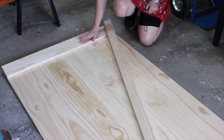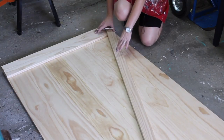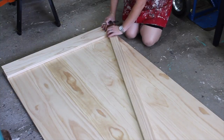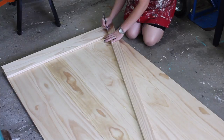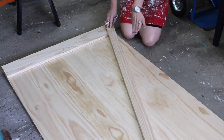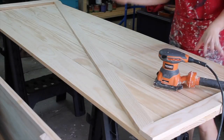Now that these are glued and nailed, they'll act as our clamps to hold everything together — once this is dry it will be nice and solid. The last part of the building is to add the diagonal crossbeam. This is completely up to you in the design you want; I like to just run mine from top to bottom. I line it up, mark my angle, and give it a cut. Just make sure wherever your cross piece goes it won't interfere with the hardware. I'll glue it just like the others, nail it down, and then we have a built barn door.